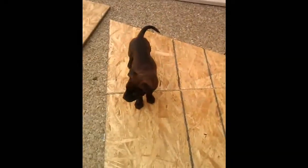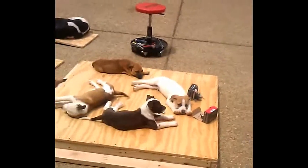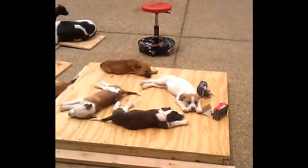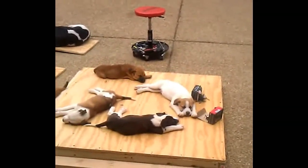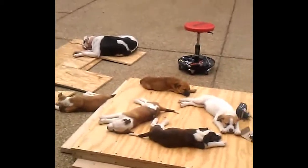This is how one of the side pieces is going to look. The top piece has a groove and the bottom piece has a groove — the male piece slides right down into that groove. You've got the slant from front to back of your roof right there so that rainwater runs right off the top. I'm going to shingle the top anyway, but that gives you your water runoff. These are my helpers — the puppies I'm building the doghouse to house and protect. Somehow they already know this is being built for them; they're already picking out their spots.